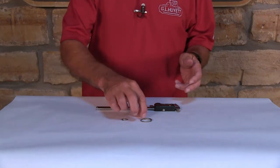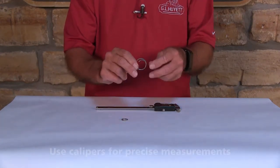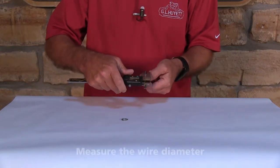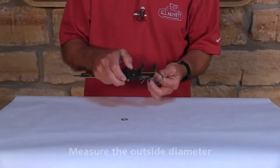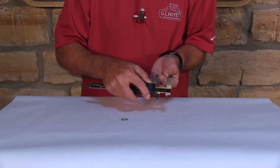What we have here is a circle cotter pin. Very easy to measure, let's measure one. First thing you want to measure is your wire diameter, and you can measure that anywhere along the wire. And then you want to measure the outside diameter. And there it is.